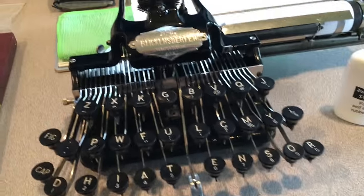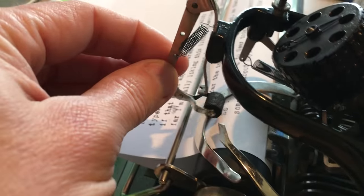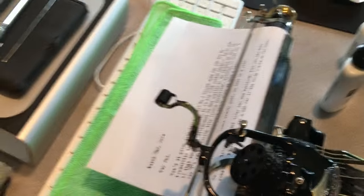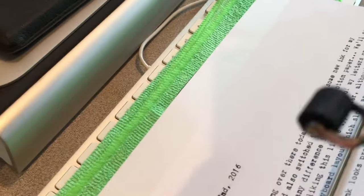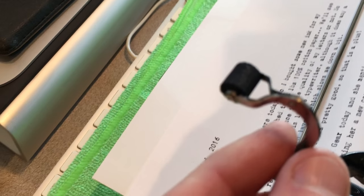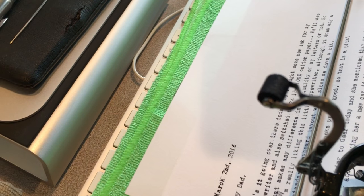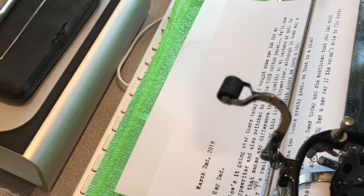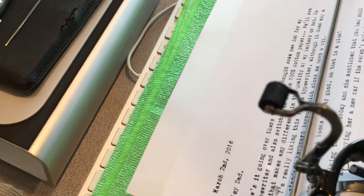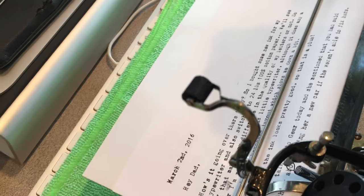First, I wanted to show the roller that I made. I was having problems with the typewriter working as well as I wanted. Turns out it was a combination of problems — one of which was the ink roller. I ended up making my own little ink roller. I did some research and found they sell an ink roller at Office Depot called a PR-40, which they use for pricing guns at stores. It was the correct diameter — I just had to cut it down.